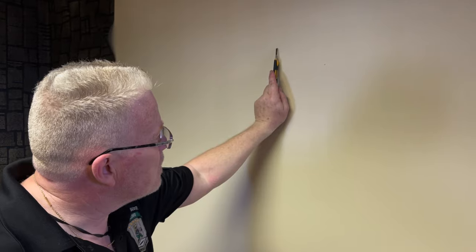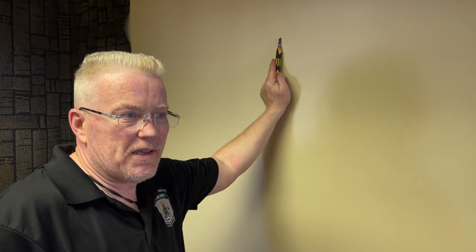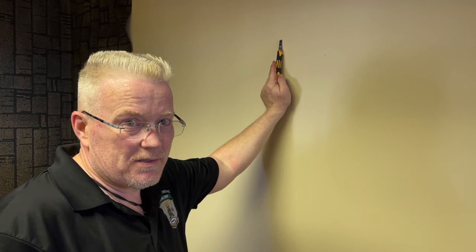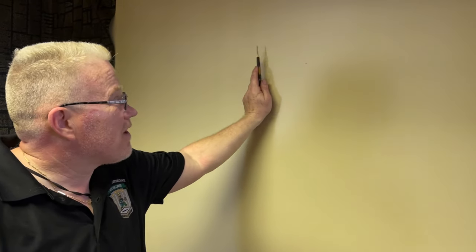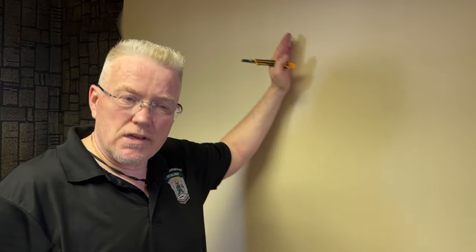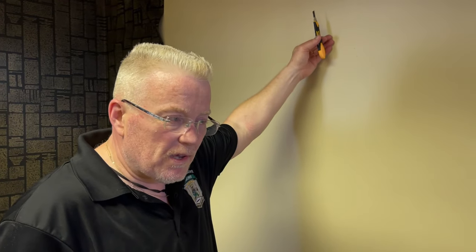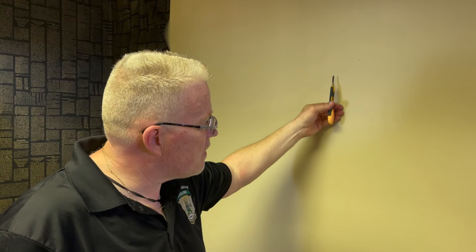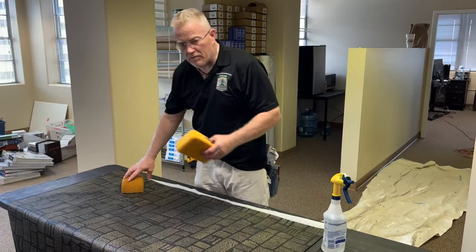If I come straight down, my wallpaper has a factory edge. If I turn the blade like this, I'm sharpening pencils. Or if I go like this, worse, if I go like this. If you rush, you're going to get a white seam. The best case scenario is to do your best using a straight edge, and you cut straight against the blade without cutting on an angle, except the 90 degree angle.